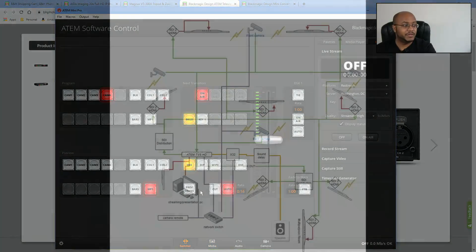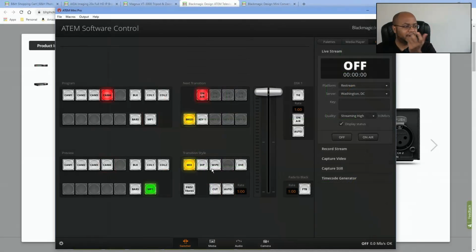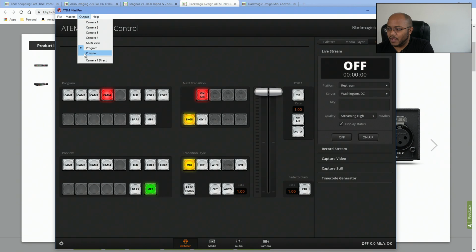to the software that I'm using to do this, oh, I already had it up. So if I have this here for the software, normally under this output, there would be an aux out, another drop down for aux out, and you can just set it. For example, if we wanted to have just announcements going over and say we're on HDMI input number 4, you can say the aux is hard coded, routed directly to output number 4. So it will always show that computer that's doing a slideshow or something like that. And then easily somebody can just come in here and switch it back to program, and now it's going to be showing the exact same thing that everyone in the sanctuary scene will be seeing here.